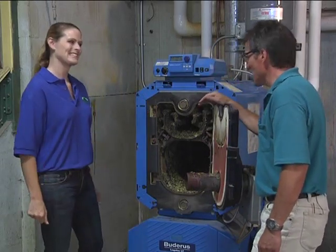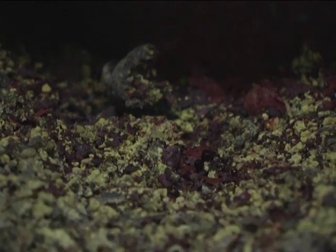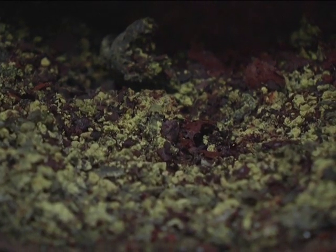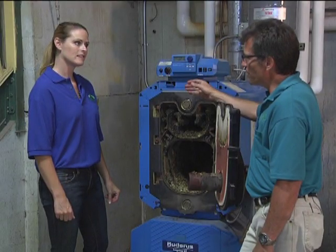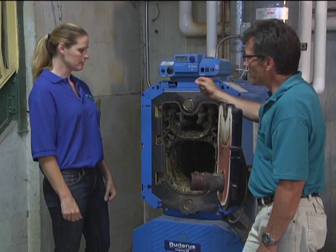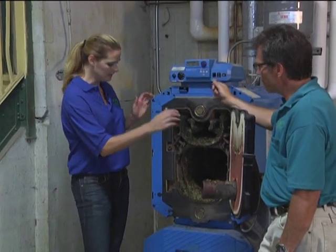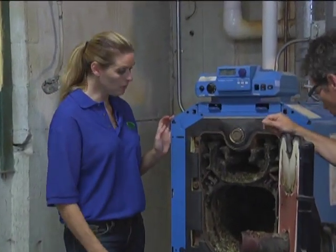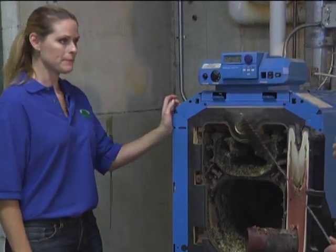The interesting thing with soot — you can see in here we have maybe at least half an inch buildup of soot. Just one sixteenth of an inch of soot buildup increases your energy cost by 10%. Really? Yeah. So once a year they'd come in, this is going to help lower my bills, and they'd clean all this out. Yes. We'll go through with a brush, a vacuum cleaner and a brush.